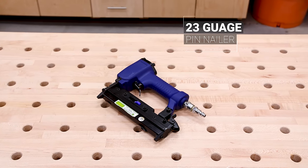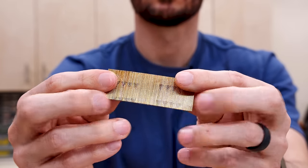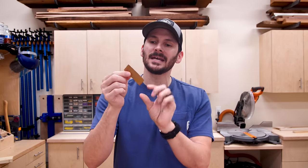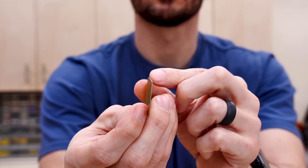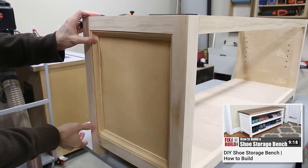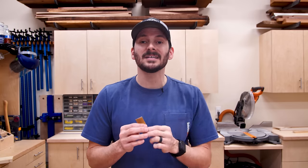The smallest of these is the 23 gauge, or the pin nailer, and it gets its name because it actually has pins versus nails. This is a headless pin — 23 gauge — and you can see how tiny it is. It just has a bevel on one side and there is no head on the back end, so it is a pin, not a nail with a head. The holding power on these is very very small, so these are for very delicate items. The nice thing is it leaves a very tiny hole, so if you want to use it on the face or surface of a finished project, the hole it leaves will be much smaller. Let me show you the difference between these three in both noise and the size hole that they leave.